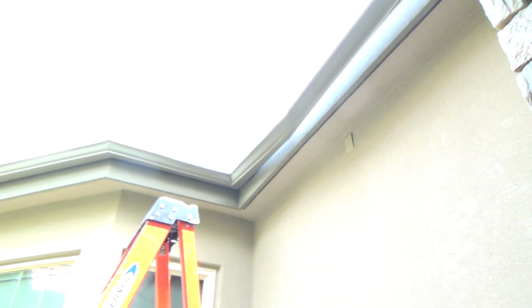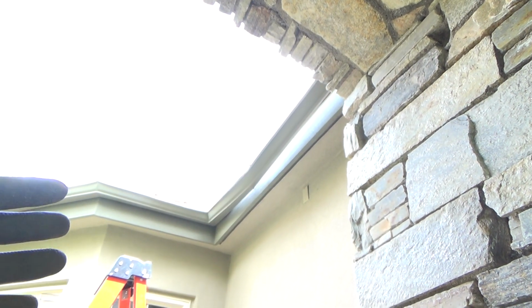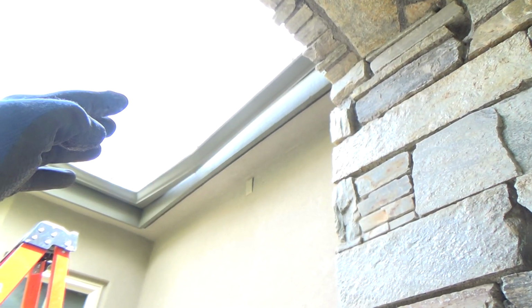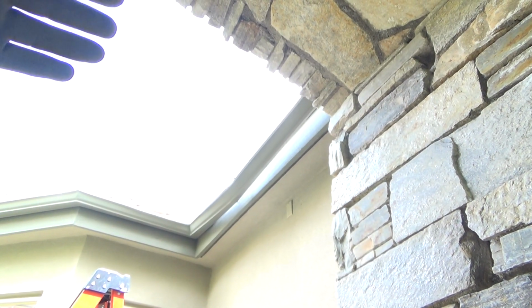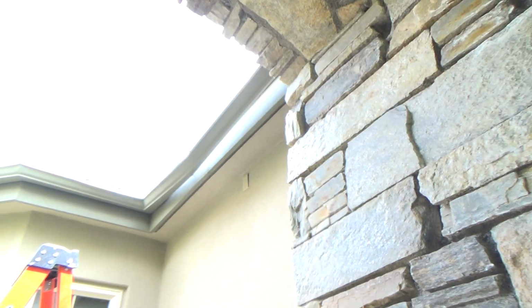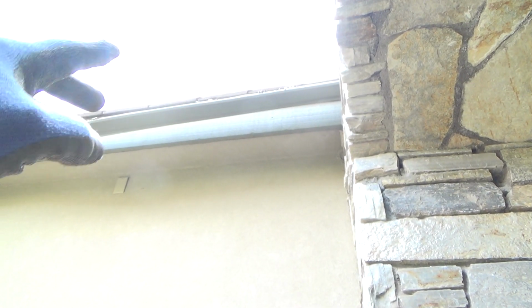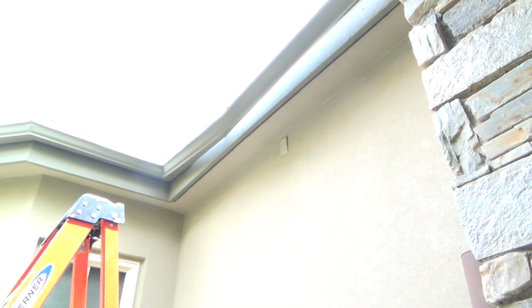An interesting observation I got too. Why on earth would this have ripped down? Years ago, they had a gutter with a flange on the outside that you would install before you install your roof, and then your roofing paper goes over that. Well, nowadays, and I laugh because nowadays, what are you talking about, 20 years ago, this one is a flangeless gutter piece, and that's why it ripped off of there. Lucky for me though, I can put it all back up and fix it, okay?